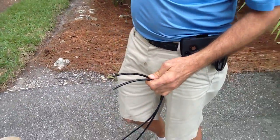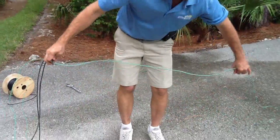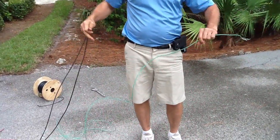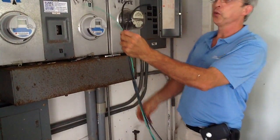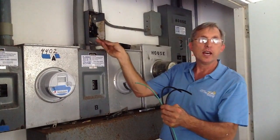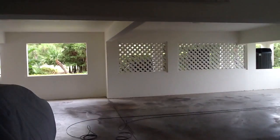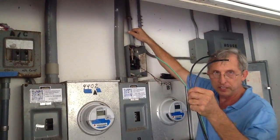Now we're going to get over here and splice in these three wires to my pulling conductor at the panel box. I've got three conductors here and I'm going to tie them onto this number 10 conductor — this is my pull wire, because I don't have a fish tape. We've got to go from here all the way back across the room, and we're going to fish this wire up into this three-quarter inch conduit. I'm going to show you how we splice these together.